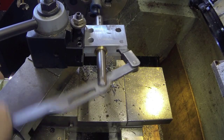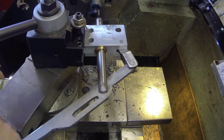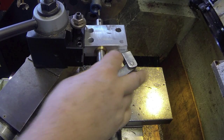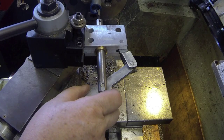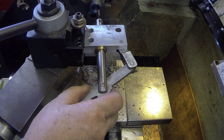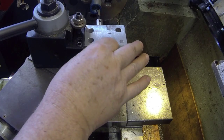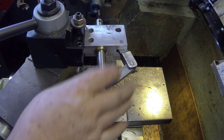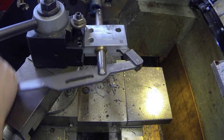That's because of the fit of the rod here. This was 3/4 inch rod that I turned down to 5/8 inch and it's not an exact match for the bushing. There's just a little bit of slop, but it's still usable.